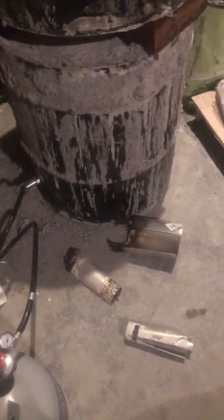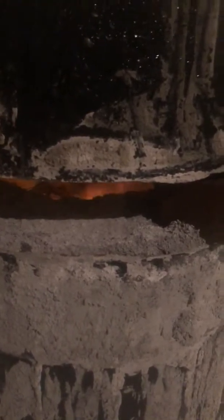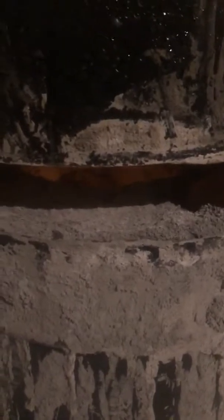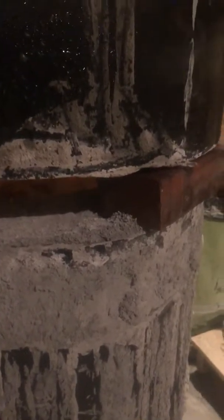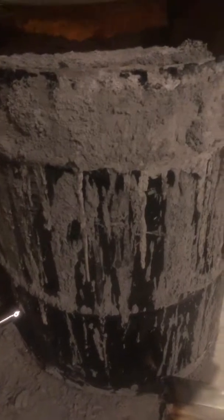I figured I could use it to make the holes to connect the inside, where I had a cardboard tube meant for cement posts. I used it in reverse — put it in there and then poured the refractory cement around it and filled it up. I had drilled a hole on one side before filling it, and I used this metal to bridge that gap and keep a hole in there so it would set that way, so I didn't have to drill the holes out after.